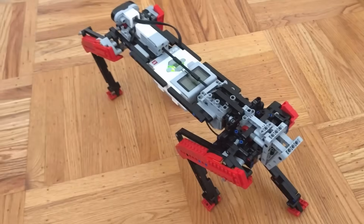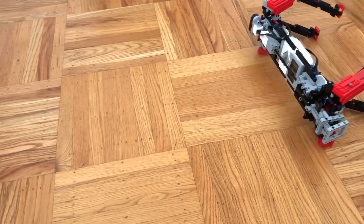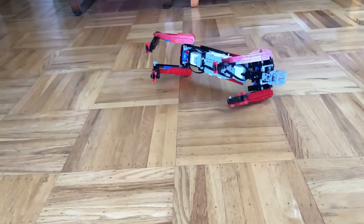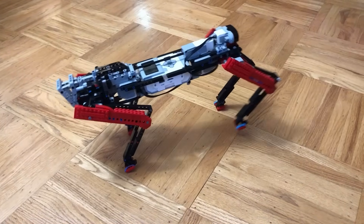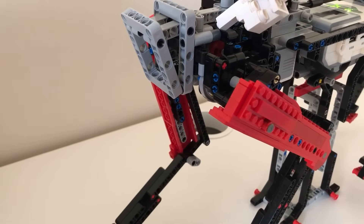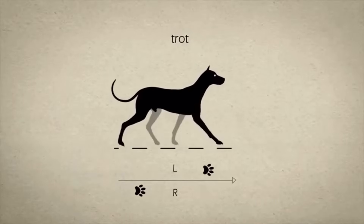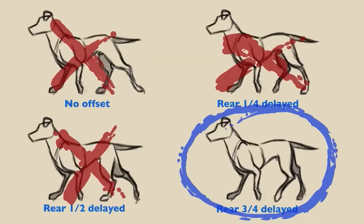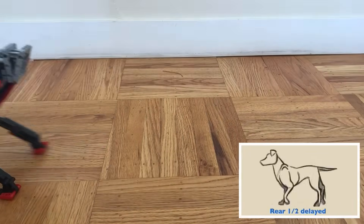It's time for the moment of truth. I made a simple program that makes Stud walk forward. Turns out the legs weren't positioned properly. No matter what I did, it just wouldn't work. But eventually, after all the failures, I finally found the solution. When the robotic dog is walking, the front and rear legs are offset by 180 degrees, meaning at least two legs will be touching the ground at all times. However, if we delay the rear legs by a tiny bit more, then each step will be taken separately, meaning at least three legs will be touching the ground at all times. And balancing on three legs is way more stable than two.